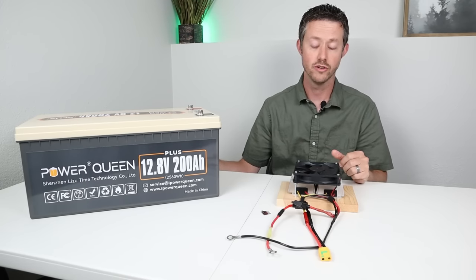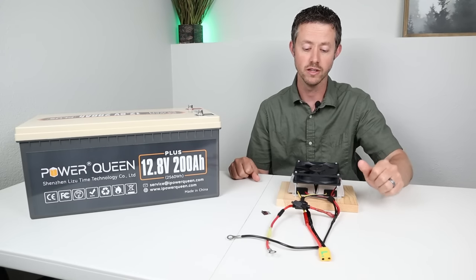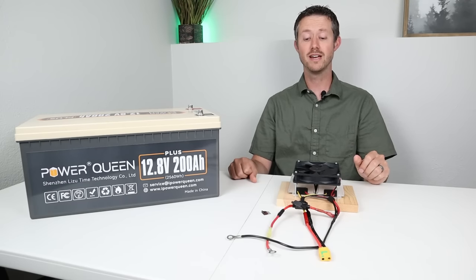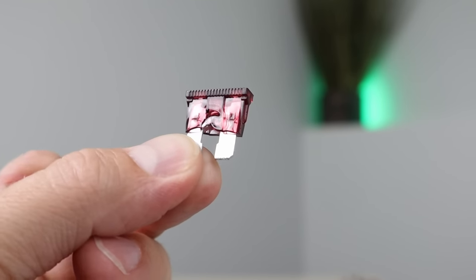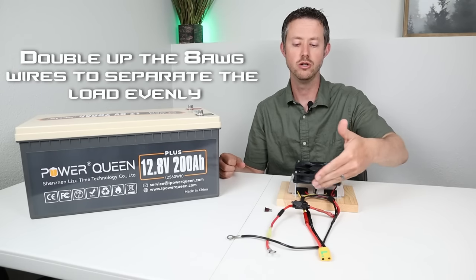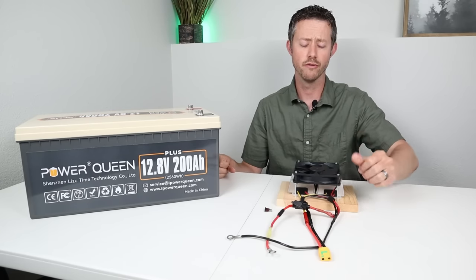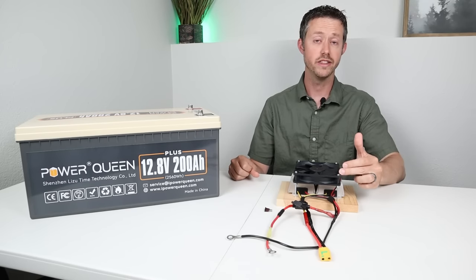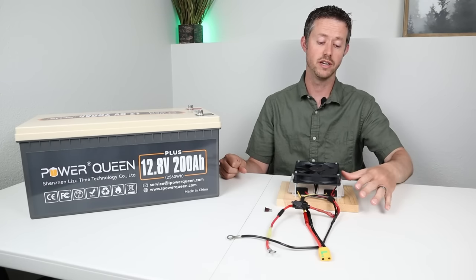About the actual converter setup, there is one major change I'd like to make regarding the fuse holders and the main power leads. We're pulling 38 amps through a connection rated at 40 amps, and when you're pulling 38 amps on a rated 40 amp cable it gets pretty toasty. In fact, the fuse got deformed and a little bit melted — it didn't completely break, but what I would do is have two main positives, two main negatives, put fuses on both positive wires, which would give better performance without overheating the fuse holders. Everything else I really like — the fan is quiet, it keeps everything cool, and it's easy to install.